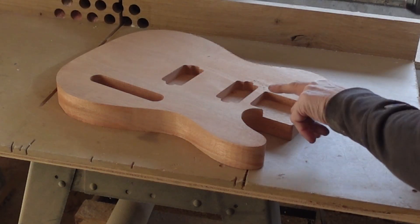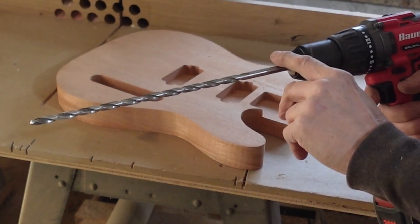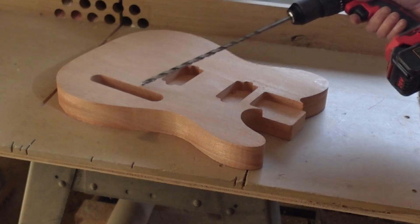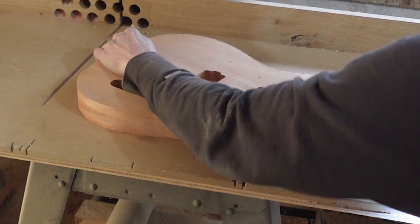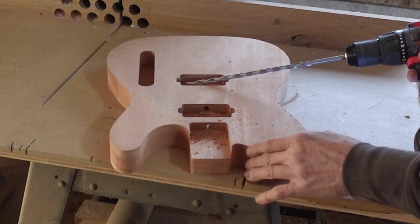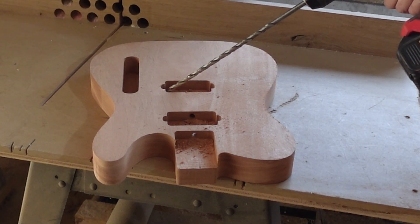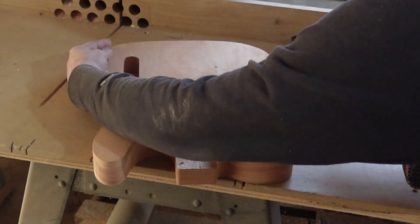With the edge done, what we'll do is we'll drill a hole through here for the wire and then drill a hole through here for the wire. I use what's called a bell hanger's bit — it's about a foot long, it's 3/8 inch in diameter. And I just drill right through the neck pocket through these pockets to here and then like this. And then when I drill this one, you want to be really careful that you don't hit the side of your bit here. It's kind of a balancing act between coming in too steep and maybe going out the back of the guitar body — you don't want to do that — or coming in too shallow and you nick this up here. So just watch yourself if you're drilling this hole.